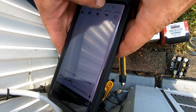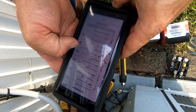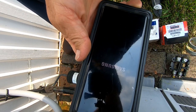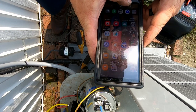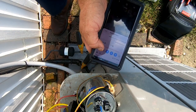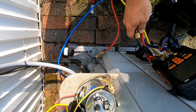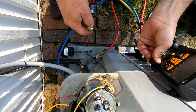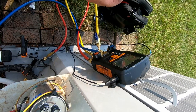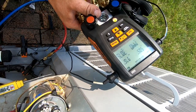The wireless probes are all blinking but not showing up - something's wrong, kind of ticking. Starting the old Note 9 - it's not finding them either. Might have to go grab the old gauges; this is the reason why I like gauges. Alright, using the manifold: 50-degree evaporator, 97-degree outdoor. I think it's at least 85 out here - actually it's 90 degrees out here. Looks like we're going to be low.